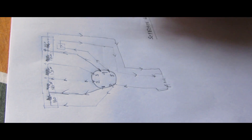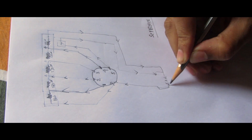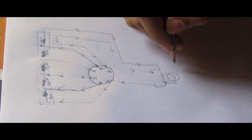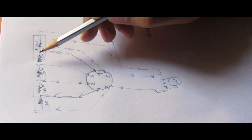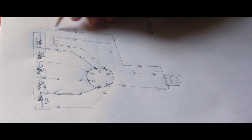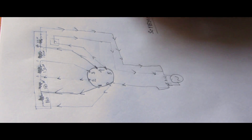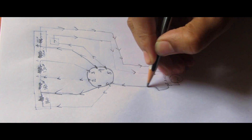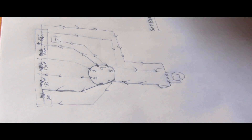When the speed is at zero, all five resistances are in the circuit. The 230-volt supply enters and goes through all five resistances, completing the circuit through the indicated path. When the speed needs to be changed to point one, the supply comes through to point one, one resistance gets disconnected, and the current flows through the remaining four resistances to complete the circuit.